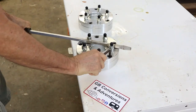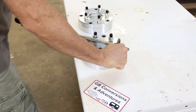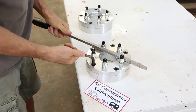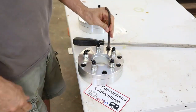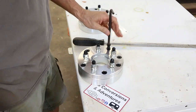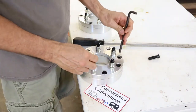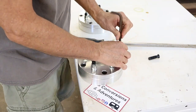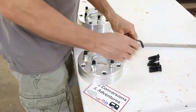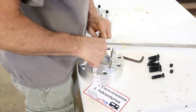These are four inch by four lugs adapting to a five by four and a half inch bolt circle. The first step in taking them apart is to remove all six allen screws. These are going to be a 5/16 Allen wrench. You might need a screwdriver or some sort of pry bar to hold them still while you break them loose.